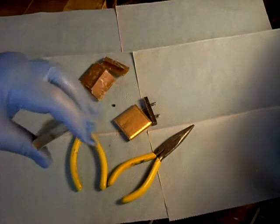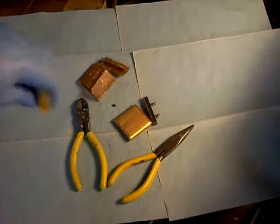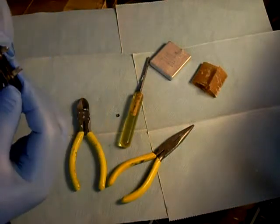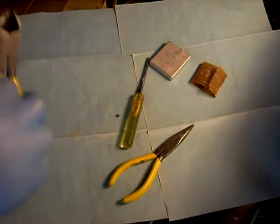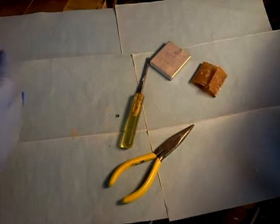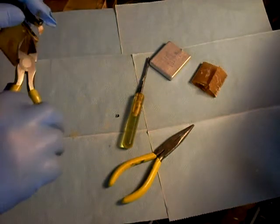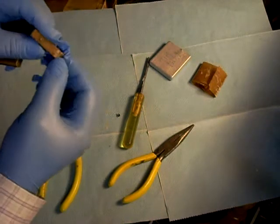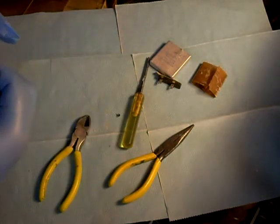I don't know whether you can see inside there. If I open the can out, you'll literally see it's just an extruded aluminium container. Here are the two terminals. You can see there was actually a mixture of epoxy resin and pitch — actually, that is solid epoxy resin. It just fired across the room. If I cut these two lead-out wires, you can see there's a fibreglass spacer there, which leads out to the two tags. This failed short circuit actually in service.